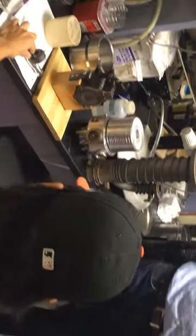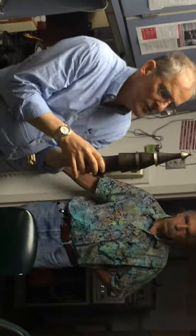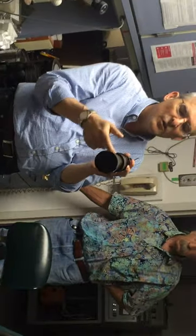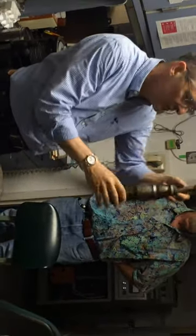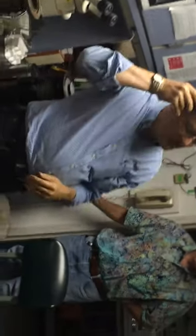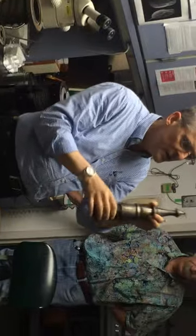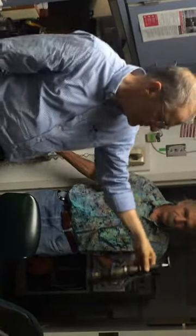This is your oil diffusion pump. You might think it works by diffusion, but it's actually also an impact pump. Here is your percolator — your upside-down funnel. You can see there are holes underneath the shield. This looks kind of like something from a Japanese samurai movie, but in our case we use it for generating vacuum.